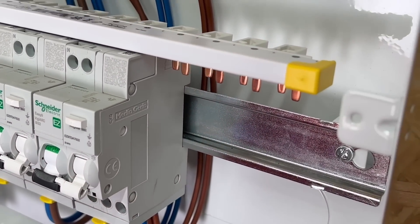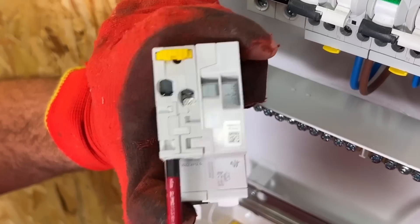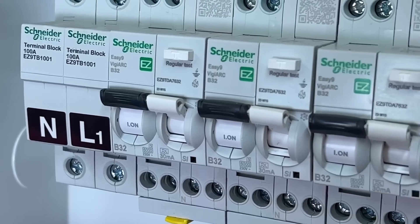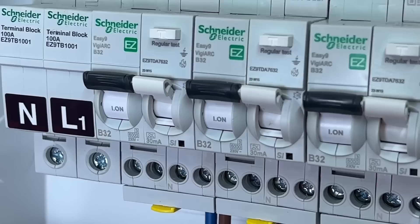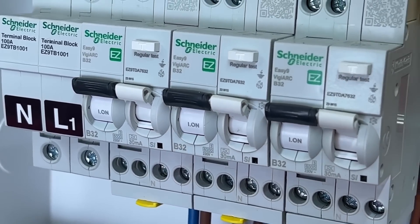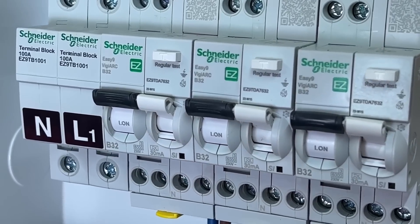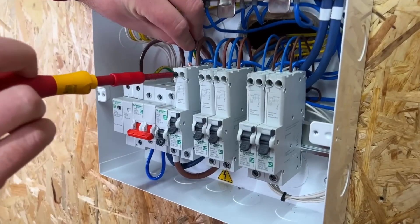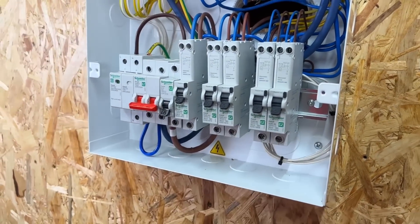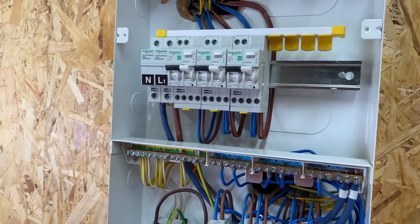I can see some copper exposed on the end here — are we leaving it like that? No, we've got some caps that we can use to cover them up as we go along. It seemed to go in with real ease there into the top of the AFDD. If you want to take a look at the top of this AFDD here, as I tighten that up or close the cage, you can see the no-miss technology. The AFDD will offer us the technology from an MCB — so it'll offer short circuit and overcurrent protection. It's also an A-type RCD rated at 30 milliamps, so we'll offer additional protection, as well as protection against serial and parallel arcs. And we know in certain instances in BS7671 these are mandated on socket outlets, single phase up to 32 amps — but in a domestic dwelling it is recommended in those locations. Recommended means you should install them, and as we move forward we will see more and more use of AFDDs. We've left a link in the description for a separate video on how we made those connections.